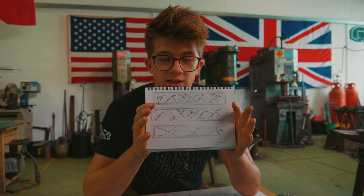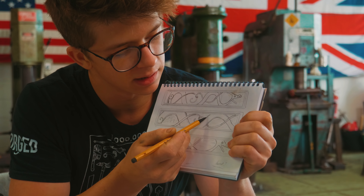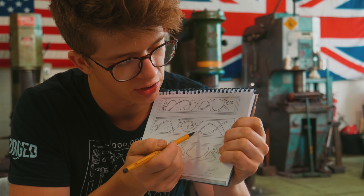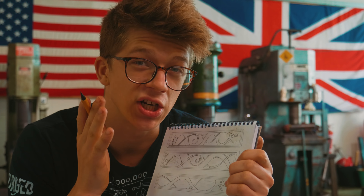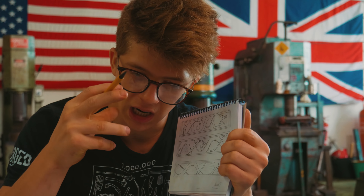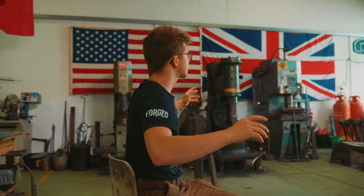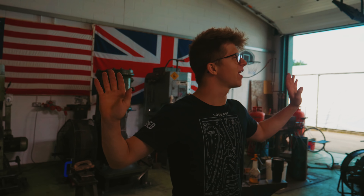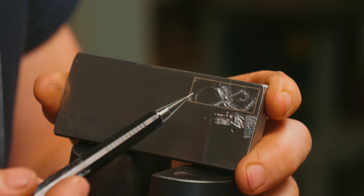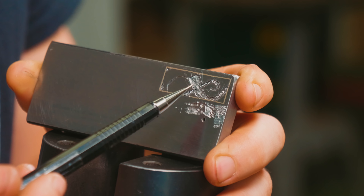What I want to do with these designs is gold wire inlay along the lines of our serpentine beasts — steel in the middle, gold on the edges — and to create contrast, shadow, and more colour and intrigue, I then want to remove the background. Two weeks since the first time I engraved anything and I'm trying to do this. Here's a little practice piece I did the other day, experimenting with background removal and silver inlay. I want to do a little more concentrated practice to work out my order of operations before we get into the actual piece with the gold.